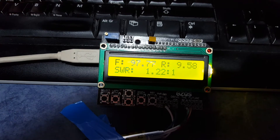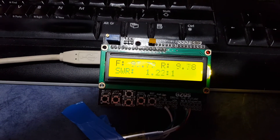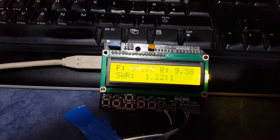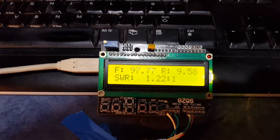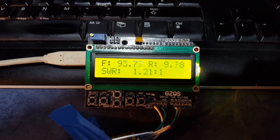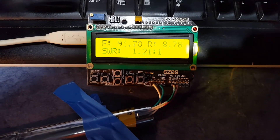That's basically all it does. If I wave my hand near it a bit, you can tap the output and you'll see the SWR go up a bit — it starts to jump. So I put my hand near the directional couplers and there you go. That's the reflection of it as the project stands so far.